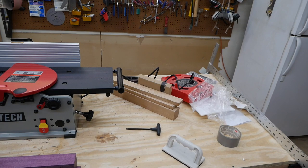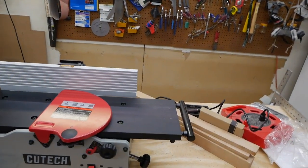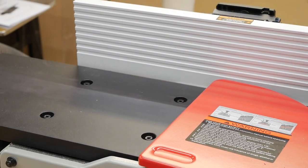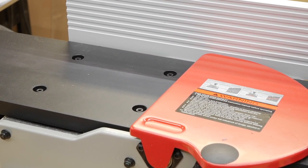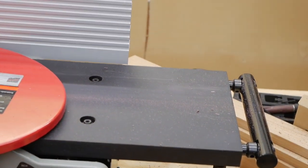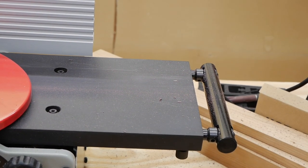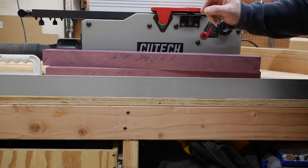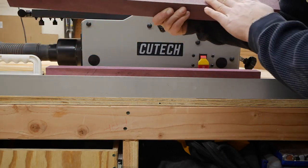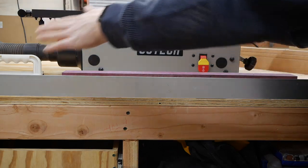There's a little bit of chip residue on this side. You can see a lot of residue on the bed — the Teflon bed experience so far, with one or two boards through, is that you can see how it's kind of streaky and it didn't really glide like I was expecting. I've got the two boards I just jointed on this edge. It's pretty smooth — I actually have a high spot right here, so this one needs to probably run through one more time. But this other one is very smooth, very clean.